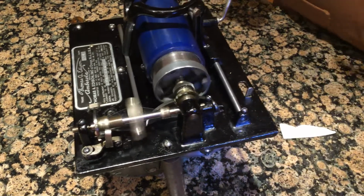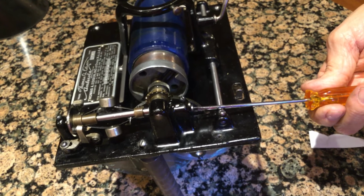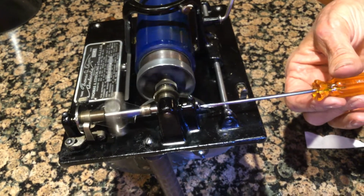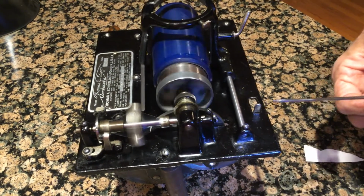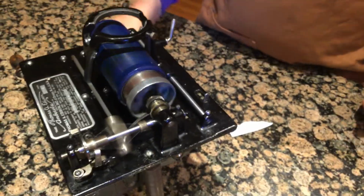and you turn the machine on, and you grind, you can bring the machine all the way to a stop. But you can take this out. You hear the little tick in it? Watch this. It goes away. Right there is the sweet spot. Now we have the absolute sweet spot of the governor. No noise, everything's running well. You retighten this, and you're good to go. The nice thing about this is you can really fine-tune the governor on an Edison machine this way, and it works very well.